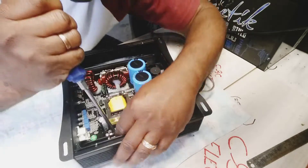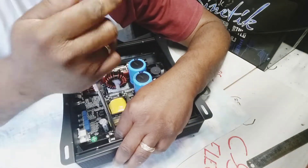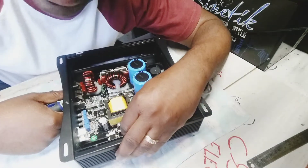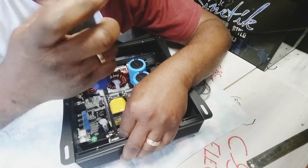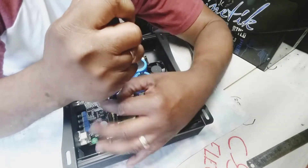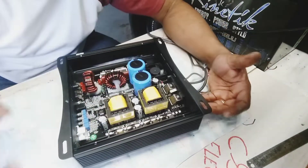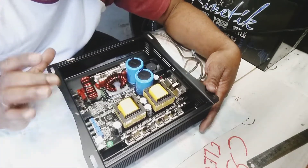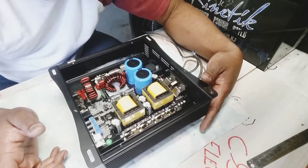I didn't check the power supply MOSFETs — I don't remember exactly what they use. For the power supply MOSFET it's H1, and I wouldn't worry about those because I replace them with the same one that the Taramp uses, which is the IRF1404. I've used those before and they were comfortable.